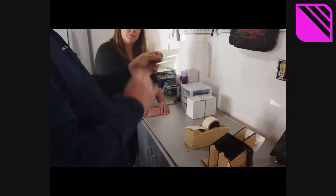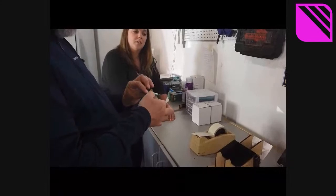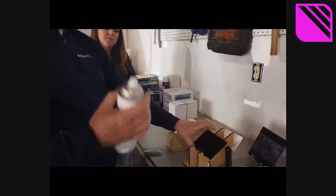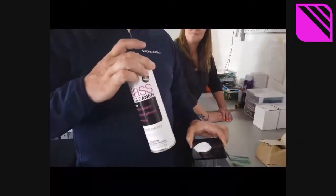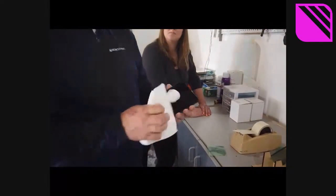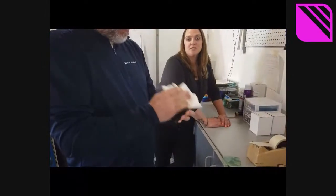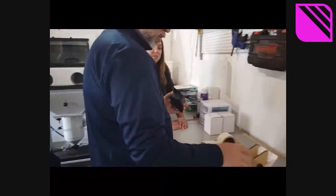Normally you'd want about a half inch of a border to help tape off on your substrate — that's recommended. We also recommend cleaning your glass with the Iconics foaming glass cleaner, which is a non-ammoniated cleaner. We don't recommend ammoniated cleaners like Windex because it'll weaken the adhesive and possibly cause the Rapid Mask to blow off. Good adhesion is critical — once you have a blow-off and etch an area that doesn't need etching, you can't go back.